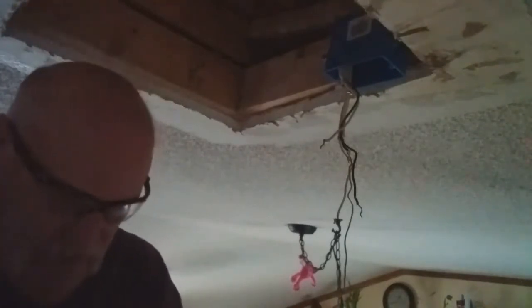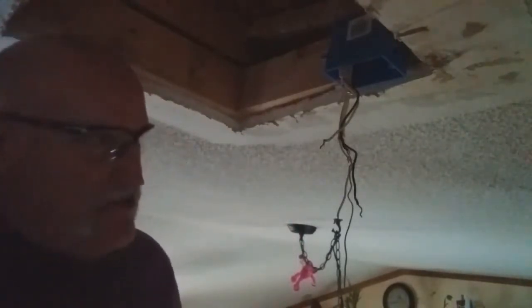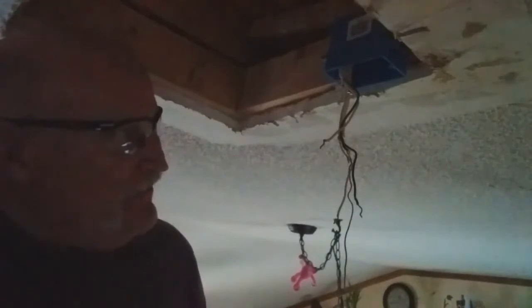All right, my friends, I got a regular outlet. I'm going to go ahead and wire my wire nuts back on here first before I do anything else, because I want to drywall up around this, and then I'll wire in the outlet. I'll probably wire the outlet in another video, just so you can see how I wire that. But this really doesn't control anything. It's just a junction box, but it might go to the power that's from the main box or feeding from somewhere else, but I don't want to make a bad choice and not hook this up. So we're going to go ahead and put the wire nuts back on here where they belong, and then we'll turn the power back on,